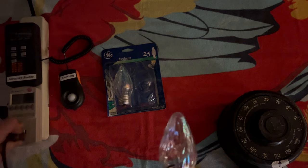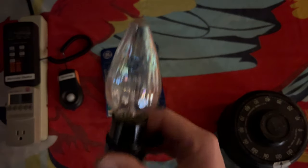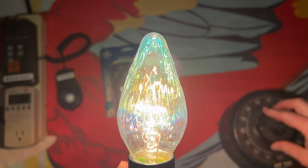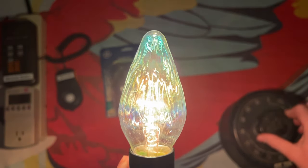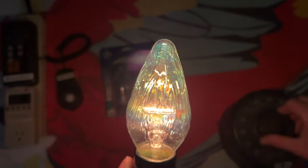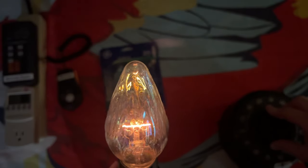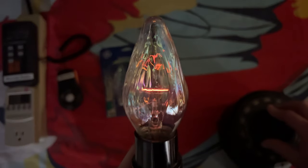Let's go ahead and unplug it and put it into our Variac. Turn that on — here we go, let's dim it down. 100. 80. 60. And you're still getting that wonderful color even with it dimmed. 50. 40 right there — not so much color, getting more of the filament color in there. Just so interesting with the horizontal filament.